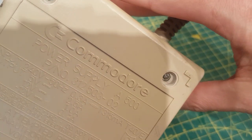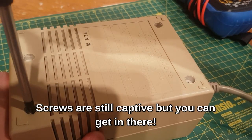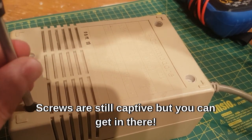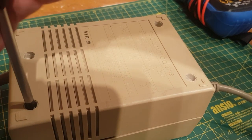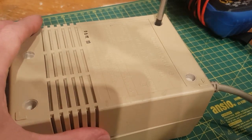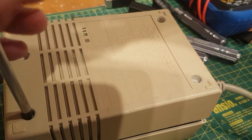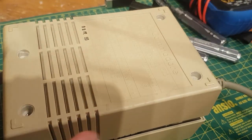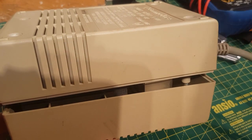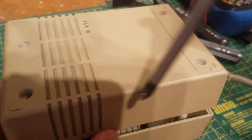I think you can probably see there's a bit more plastic to come out there. I'll attempt to undo it as it is — I've got the screw heads exposed. What's happening is because the screw is effectively captive, I'm going to have to do a kind of pressure relief as we go. I've seen people destroy these, which is a shame, because if nothing else you'd want to keep the case. Because the nut is captive, normally the screw would come out, but because it's got plastic on top, the only give is to shaft the bottom of the case out.